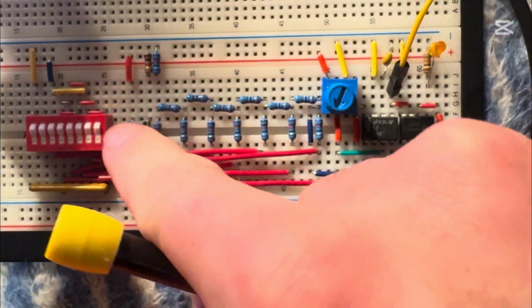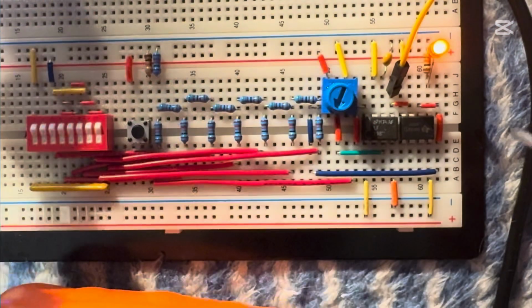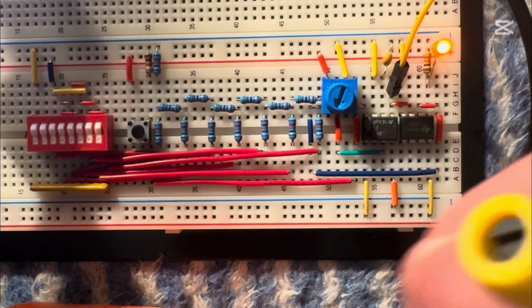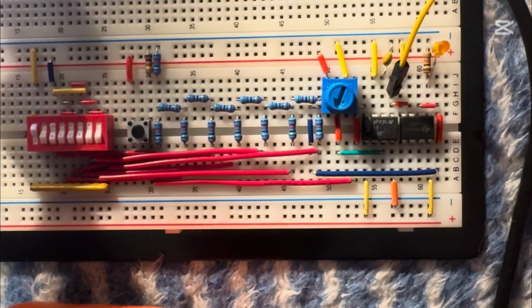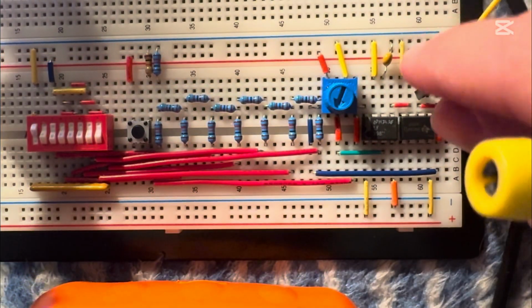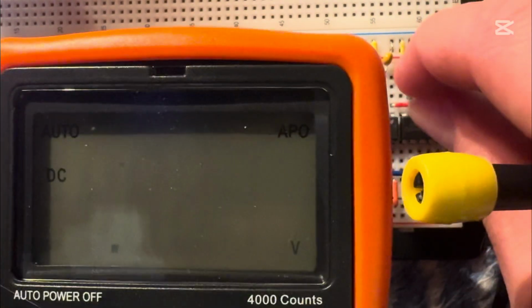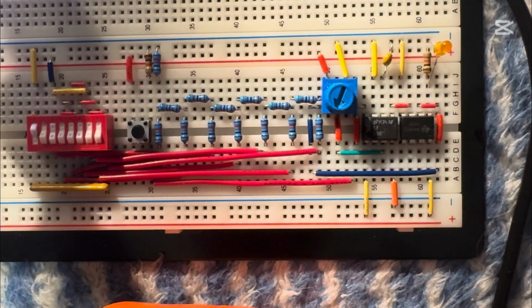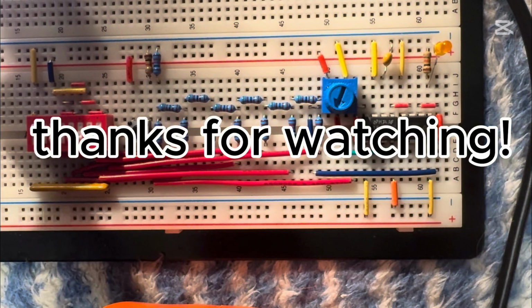If I change it to 2.8 volts, sample and hold is greater than the R2R, so the LED turns on. Opposite of that, if I turn this all the way up, see here, it's at about 5 volts. That at 5 volts is more than 2.7 volts, so the LED turns off. Well, that was my project 3.4.1, or 3.4.2, sorry. Thanks for watching.